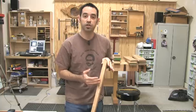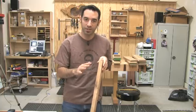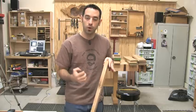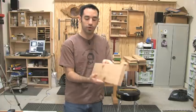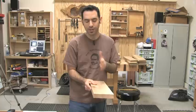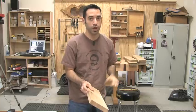What I like to do at this stage is fill that knot with epoxy, usually an epoxy that's been dyed to a color that might make it look natural. That'll reinforce it, hold everything together, and make this piece usable. I may wind up just putting that toward the inside of the box, but this way at least I can still use the piece of wood. Let me grab some epoxy and I'll show you how I do it.